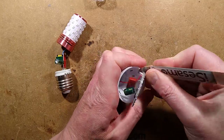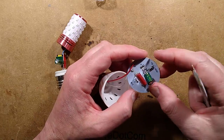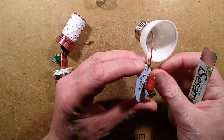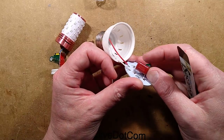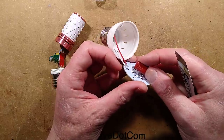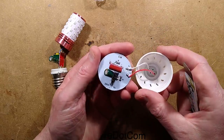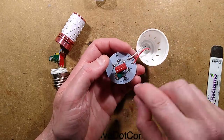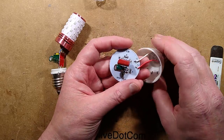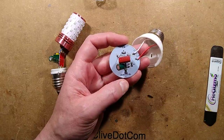I feel inclined to modify that other one as well, but it really is cramped for that resistor. Let's see if we can spudge the circuit board out of this one to reveal a capacitive dropper — so that's going to be an easy mod. Finger test. What value is the capacitor? It's 684 — that's 680 nanofarad. So we could change that for a 330 nanofarad capacitor. I'm going to doodle the schematic of this down, then we'll change that and see what power we can drop this down to.